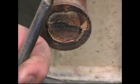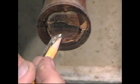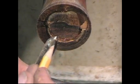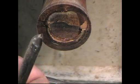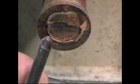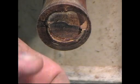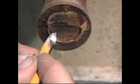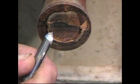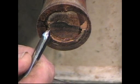This is a cutting edge again, up here, and everything back here is taken away so you can make easy, smooth cuts, not bang the bevel a lot, and make the same cut. That's the theory behind this. I can make the cut, but I'm not banging the bevel, and I can turn corners easier. You'll understand more as we get into this piece.